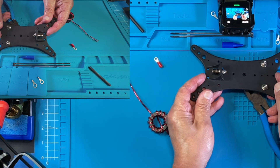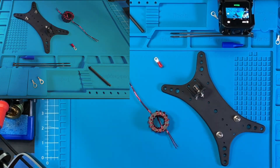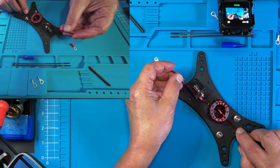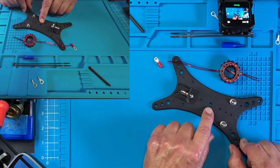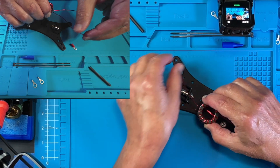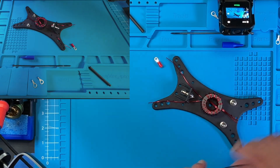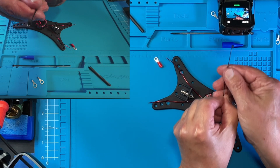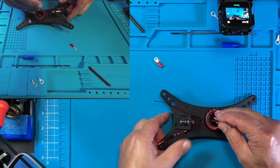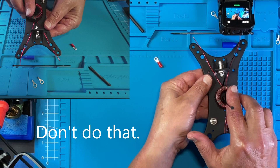Next up, let's get our wrapped toroid in place. The zip ties are going to go through the center hole and then these two outer holes. I'm going to put this on first without cutting my wires, and then we'll come back and manipulate the wires later. I'm going to orient this way on the zip tie that's going to the left — down through the middle, up through the hole — and I've gone in between the two wires. That's the way I'm going to do it.